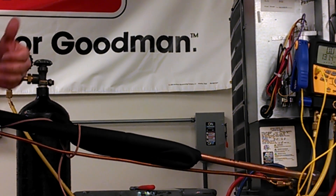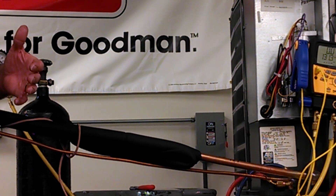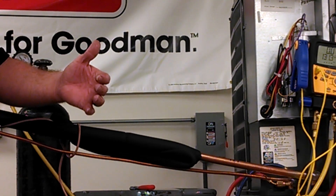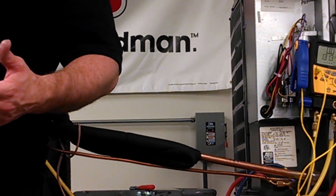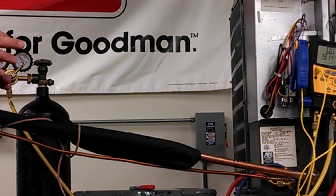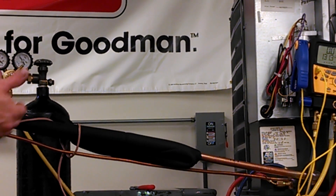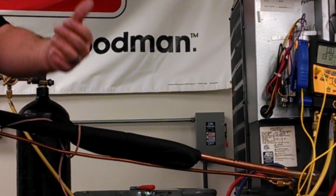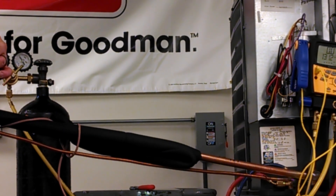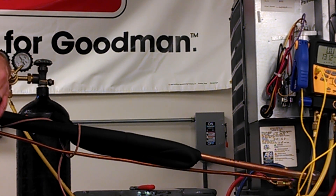Some people go higher than that. However, you've got to be careful not to exceed the maximum rating on the lowest pressured part of your system, which generally will always be your coil. It'll be listed on your coil for a minimum and a maximum amount of pressure. So generally speaking, in order to be approved for both 410A and R22, these are going to be minimally UL listed at about 250 PSI.